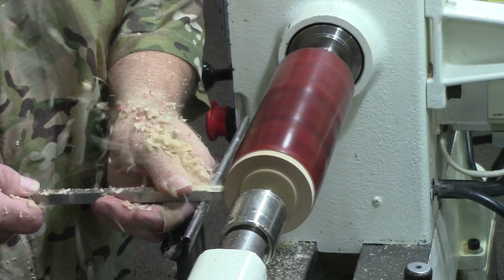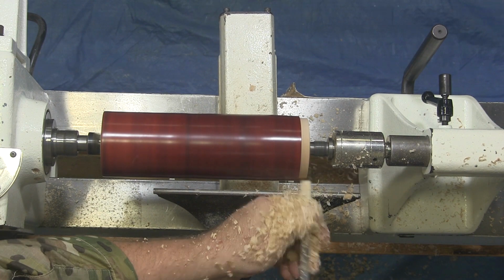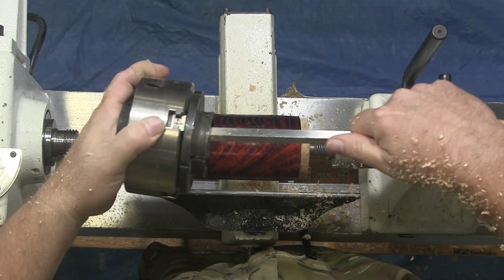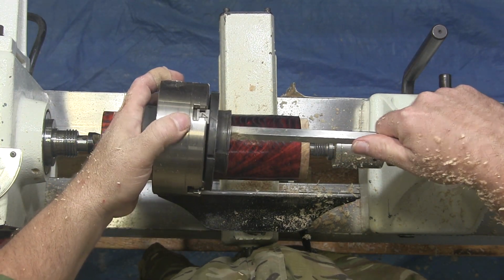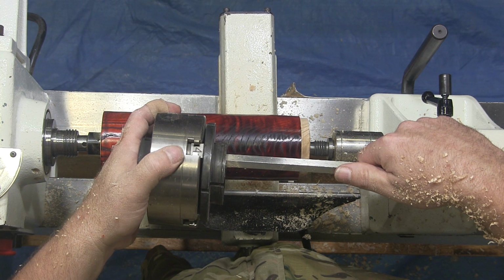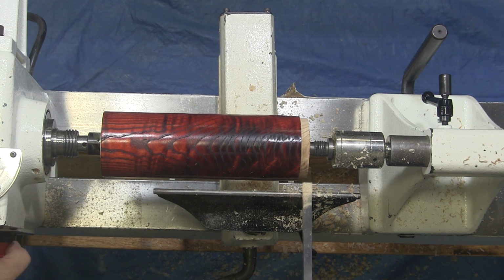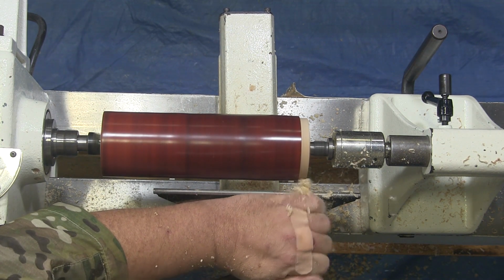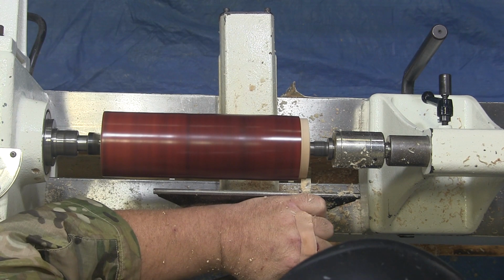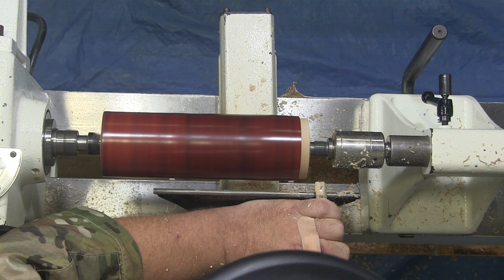And the interesting thing about this easy wood cutter is it is just about perfect for these jaws. Okay, so the size of that cutter is just a little bit smaller than as if it were to bottom out. Okay, so if I cut my tenon, and you'll see I'm creeping over with this tool, you can cut in or across. It's flat on the tool rest. It's not at an angle. They are not advertised to do that.